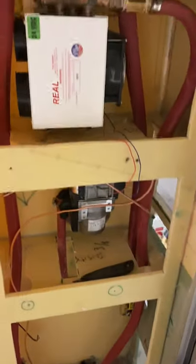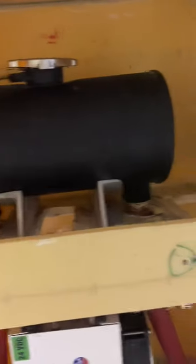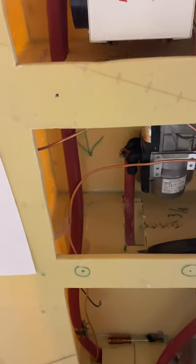That's going to get tied down to that — there's got to be a barb put on there. I've got to snake a hose around through there and get that one picked up. This is an expansion tank and that's hooked up. There's actually an aquastat there — that's a thermostat for the line. It won't turn the fans on until the temperature in the line is up to 120 degrees.